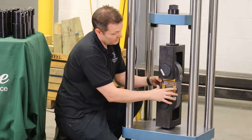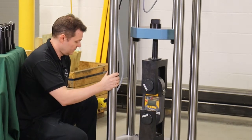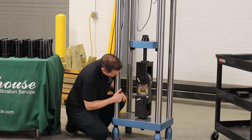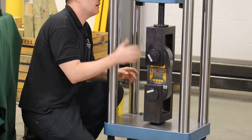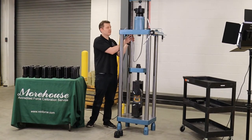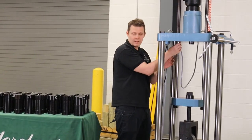The next thing you want to do is turn the instrument on. I want to center this because I don't want any side loads, eccentric forces, or anything of that nature. I picked up the instrument — this whole adapter set weighs about 50 pounds — and I'm going to zero that and center everything. From there, I'm ready to go. When calibrating, I want to watch these holes and make sure nothing is touching internally on either side when I start to apply forces. An easy way to do that is to take a piece of paper and make your way around to make sure nothing's touching.